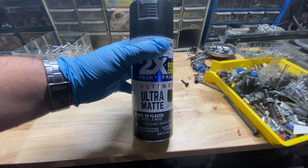Try to do it on a surface you don't mind sacrificing — like I did with the cardboard here. I'm on what I believe is my second coat; I think I only did two coats for all the furniture. Your experience might vary, so just be prepared. A big tip: when you're spraying, don't start spraying on the furniture — spray off the furniture and then come on to it. That way you don't get blotches.